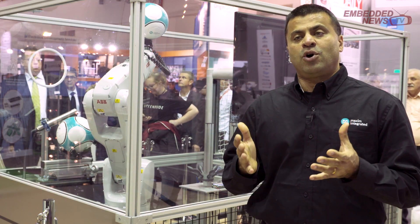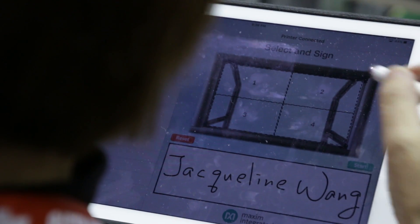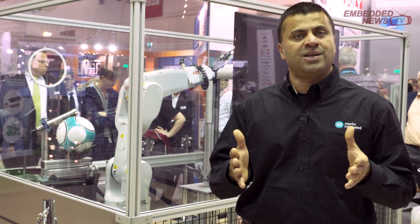Once the bounce height is determined, the ball is taken to the kicking station. The Pocket IO PLC development platform determines exactly which quadrant the user has selected and then turns the light beams in the light curtains on and off to make sure that quadrant is active.